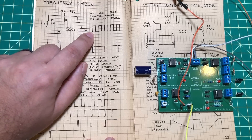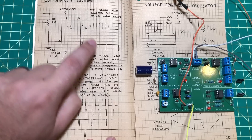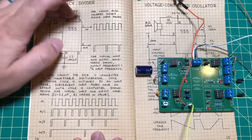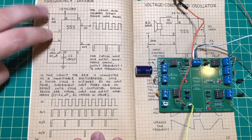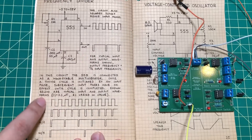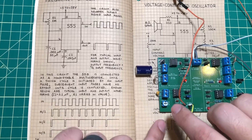Looking at the example: we have a square wave that starts at the bottom, goes up, and does square-wavy things. On the output side we have sort of the inverse — the square wave is going down. Every single time the input frequency goes high, this one wants to go low. It wants to pass the frequency straight through, but we have this capacitor and resistor which act more like a frequency blocker. The triggers are always across from each other, and the trigger on the output has to be below one of the existing triggers going high. The difference is the missing teeth in the middle.